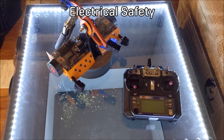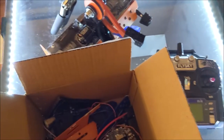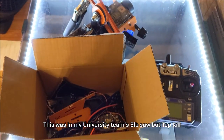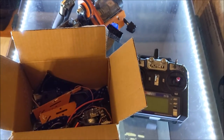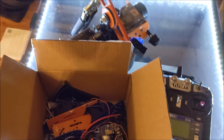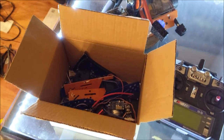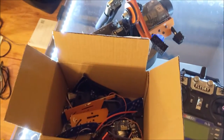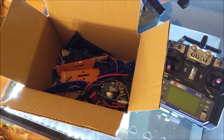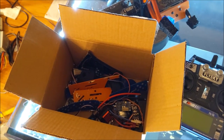There's one thing that I've learned as a bot builder: when it comes to electronics, they fail — a lot, often in very unexpected ways. I've had cases where I had an ESC in my robot, it fought and finished the fight driving just fine. We take it into the pits, service completely unrelated parts, put it in the test box, plug it in, and that ESC smokes and blows up. I've seen that happen to somebody else at a recent Norwalk competition — somebody put their robot in the test box, plugged in the battery, and the ESC just blew up randomly. It's always possible when something like that happens that it could short the LiPo and cause a fire. That's one of the reasons you definitely would be advised not to plug your battery into your robot while it's in the pits, because you never know what might fail unexpectedly. You definitely don't want to be next to your robot while it's on fire if you could instead have a Lexan shield between you and the bot.